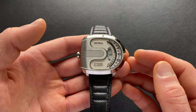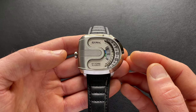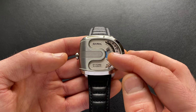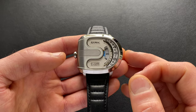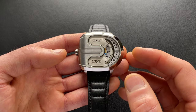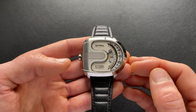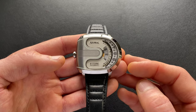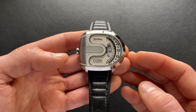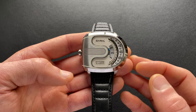While I always do prefer the 9 series, I've had great luck with the 8 series movements, and I really don't think it makes that much of a difference here. One of the things you do lose is the ability to hack — however, with the second disc operating like it does, it's really not a big trade-off there. The water resistance is fairly diminutive — only 30 meters or 3 atmospheres — so basically just splash resistance. I'd be cautious even washing your hands with only 3 atmospheres, but it's to be expected with the style of this watch.